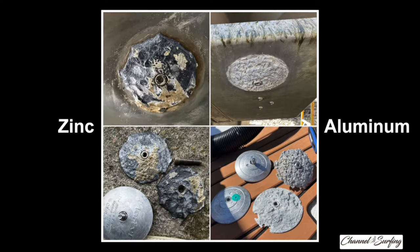Once I started hauling the boat out of the water for a week here, week there to do maintenance several times throughout the year, I started noticing they weren't dissolving like they should. They would get crusty and start to look like the surface of the moon — big craters and stuff in them. What I came to find out is that zinc, when exposed to air, will create a protective film on top of it and that'll cause it to stop working. Also, if zinc is hit with fresh water, it'll also get a protective coating on top of it and stop working.